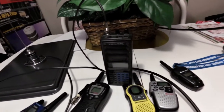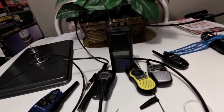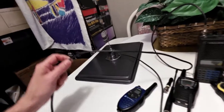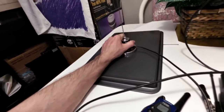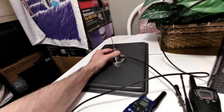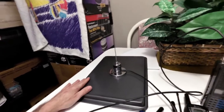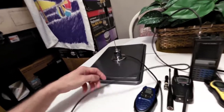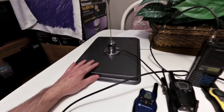Another trick you could do is get yourself a cheap scanner — you can find them on eBay pretty cheap, I got this one for about $10. It's an old scanner that covers the FRS bands, UHF 462 MHz. Attach it to an external antenna like this — this is a magnetic antenna used by couriers and mobile applications. This one is the MUF4505 by MaxRad; it has a tuning chart, you can tune it to 463 MHz and it has 5 dB gain. It will dramatically outperform these little built-in antennas. Attach it to something metal like a filing cabinet or a cookie sheet pan to give it a ground plane.